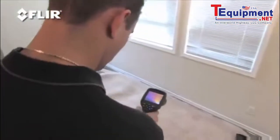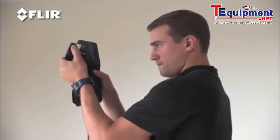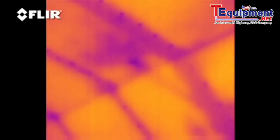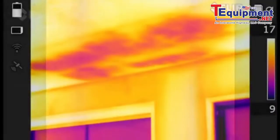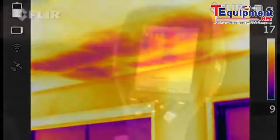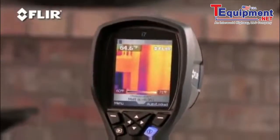When the room is pretty much dried out, take time to look around for anything you might have missed and also to find other potential problems. For example, in this area you can see the studs in the wall — these dark points here are actually drywall screws. This looks like some of the insulation may have been removed from the cavity, maybe from getting wet or perhaps it was poorly installed from the start. The insulation is completely missing here. This place could use some improvements.